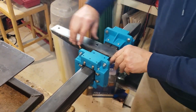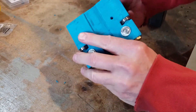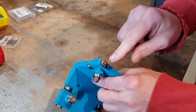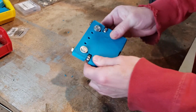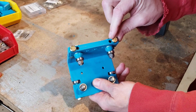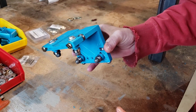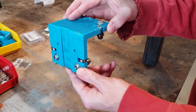This is just a scrap piece we brought in, and we'll have the X-axis going out there. We printed this part for the X-axis and made a little one-inch slot for our torch holder to keep it square. We also put slots in here for these bearings to fit inside — held in place by a quarter-inch bolt tapped into this area. We added slotted holes for the other axis, and Allen screws go into the slots and push on two sets of bearings so we can get a tight grip onto the tube we're sliding on.